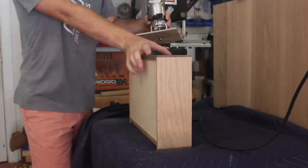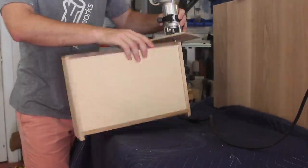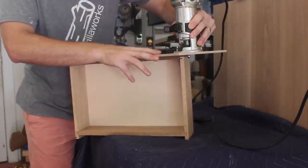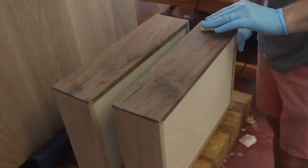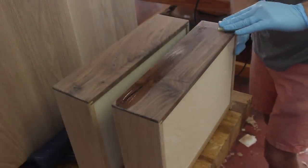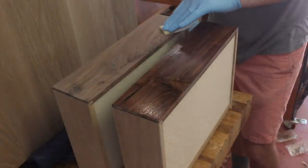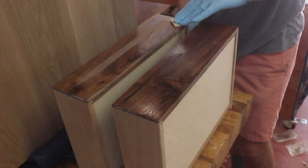I did a little bit of final sanding and edge treatments before applying finish. The drawers got my usual walnut oil, while the table got the rest of the charcoal Rubio Monocoat. I applied it much the same way I did before. In this case, I had the two sides which were vertical, so I had to get a little creative to apply the oil without dying.